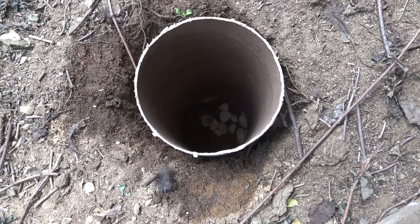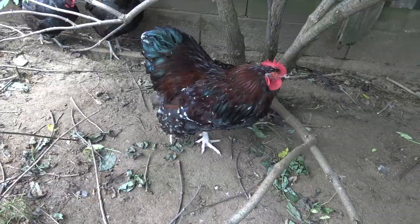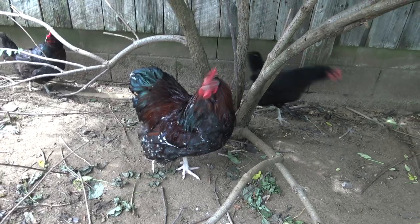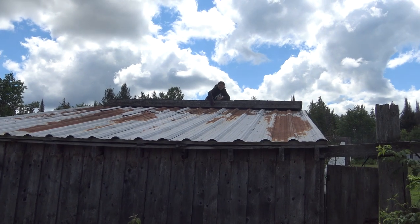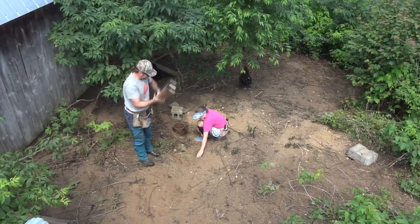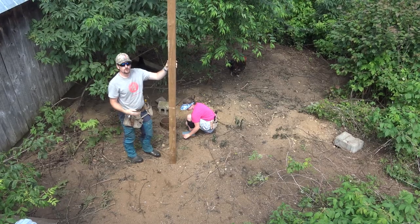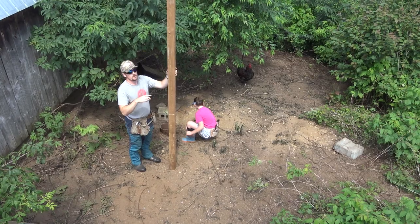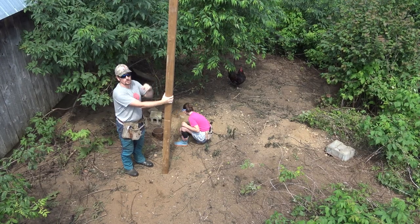We're also going to pack stones and sand back around the outside. There's a jubilee Orpington rooster over there — he's going to get a shot of us working from up top. This is a 10-foot pressure-treated 4x4 post, and we're aiming for it to be two feet underground. The fencing we bought is 48 inches, so it should go up four feet, and then up to the top will be eight feet — that'll help keep our two flocks of chickens separate from one another, since they won't be able to fly over an eight-foot fence.